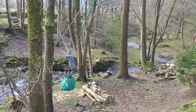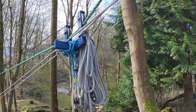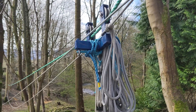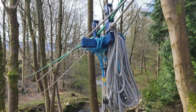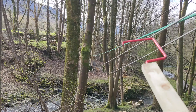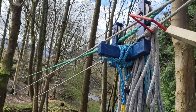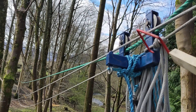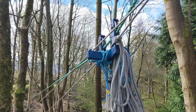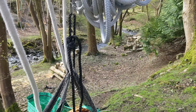Here comes the load, and the plan is to stop it pretty close to the top — there we go. Because I don't have a third hand to operate the handbrake, it's drifted back a little bit. Normally what I would do is engage it with this captain hook, which just clicks around that trolley, and then once it's clicked on I can reduce the power and the trolley won't go anywhere. So with the power off, all I now need to do is pull on the cord — here's the cord — pull on that one.